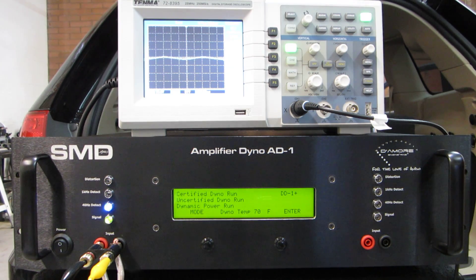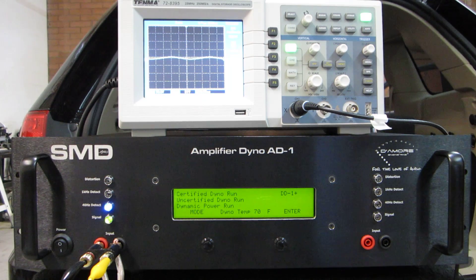The Amp Dyno has conventional DD1s in it, but it also has a new function called DD1+. What DD1+ does is give you the ability to set your gain overlap not just in steps like the original DD1. The original DD1 had steps of 5 dB, 10 dB, or 15 dB of overlap. With the DD1+, it's dynamic and continuously variable — you can put it at 4 or 7 or whatever you want it to be.